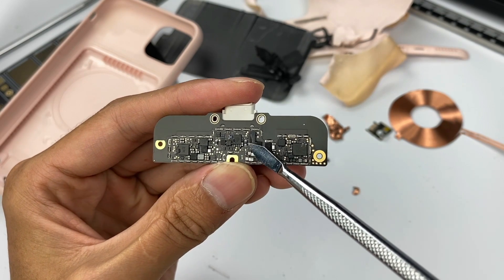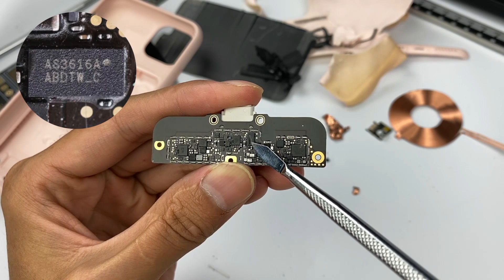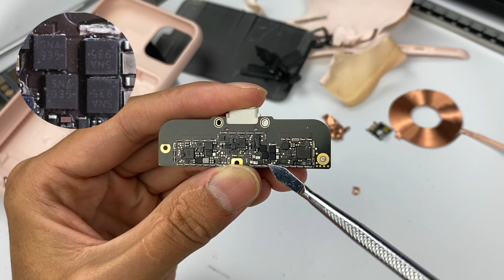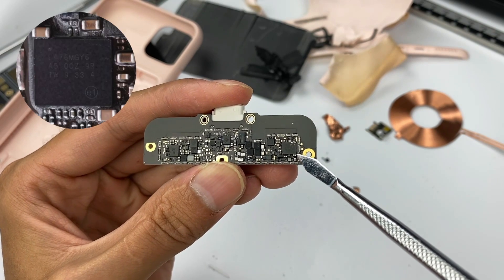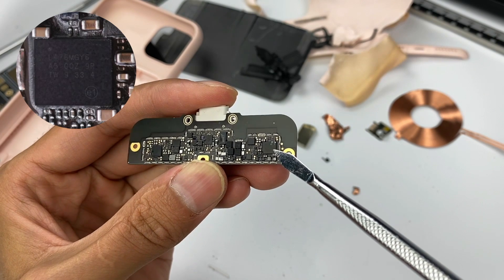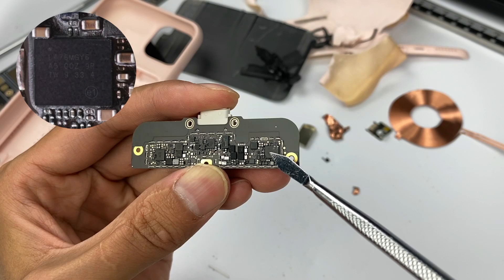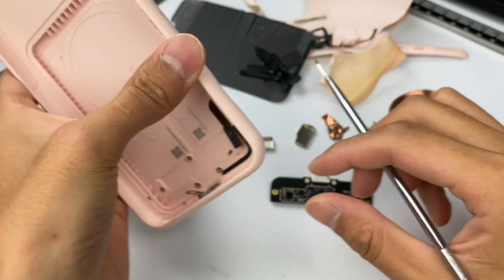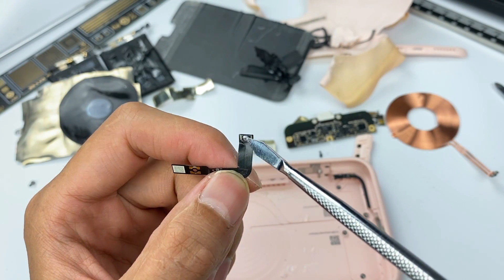The rectangular chip is the master control chip of C94, marked with AS3616A. Here are 4 MOSFETs for synchronous buck-boost. The largest chip is the microcontroller from STMicroelectronics, packaged by WLCSP81, and marked with STM32L476MG. That's all for this PCB. One more thing: the newly added camera button has a switch on the flat cable.